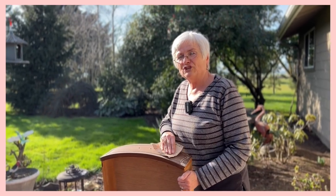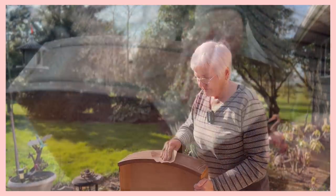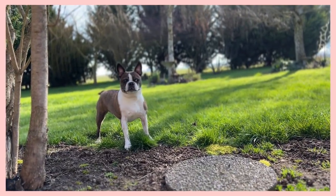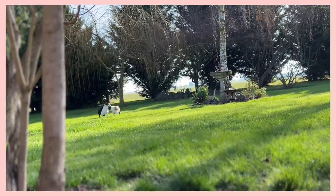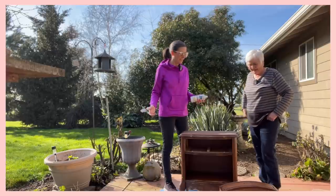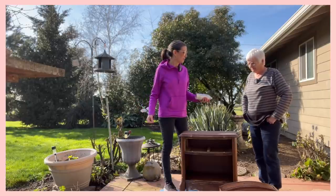It's good when you're sanding to go in the direction of the grain of the wood. So I'm going to go the length of the piece — that way it looks more natural when you paint. After we sand, wipe it down with a microfiber towel and then go over it again with a damp cloth before you put any paint on top. Then we're doing primer in spray paint form — so much easier. You could also use something like Kilz for grip.